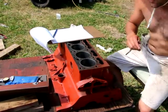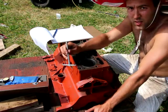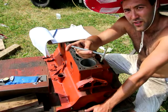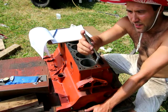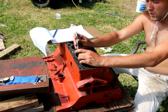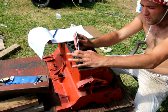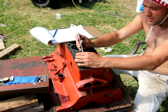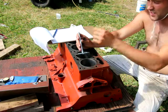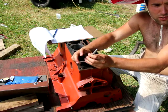This is going to be a short series on how to measure engine parts. In this case I'm measuring the engine bore, and I'm first going to use this little tool here. It's shaped like a T, and at the end there's a spring inside at the smaller part, and these two little pins are forced apart. The spring holds them apart, and when I put them in the bore that ensures that they touch both sides.